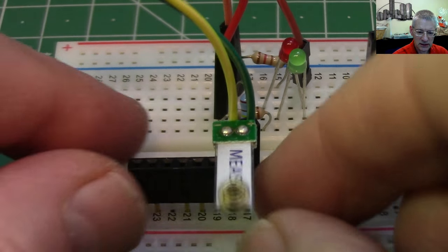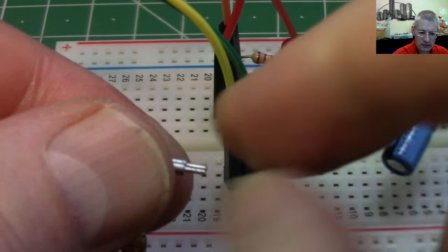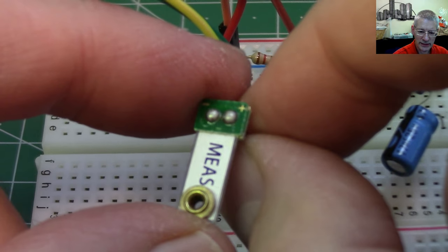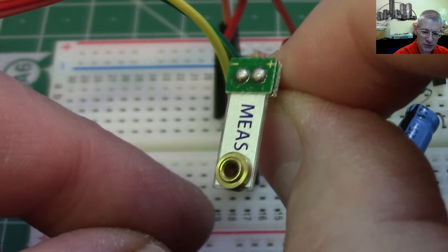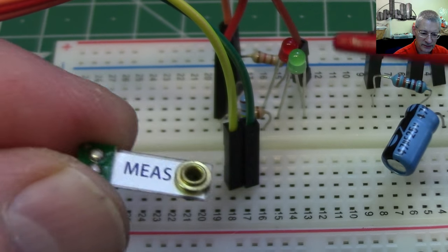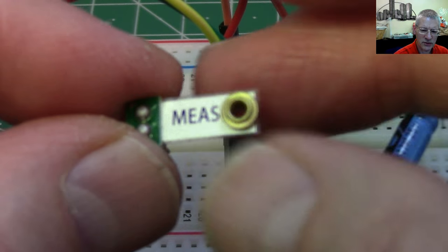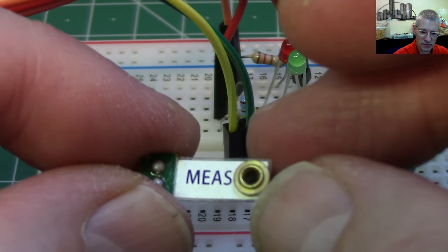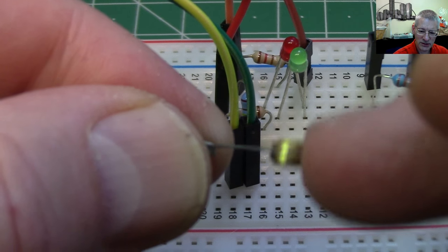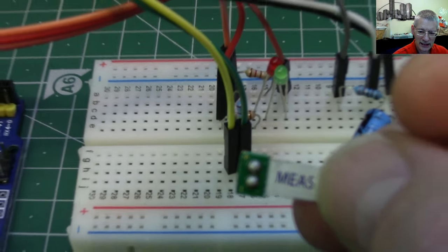You do have to be a little bit careful about soldering this — it sits on two little pegs. As you can see compared with my fingers, it's pretty small. This is the piezo bit on here, and this brass thing on the end isn't some kind of antimatter dilithium crystal — it's just a bit of brass acting as a weight. As this starts vibrating, the weight keeps it vibrating so you can detect it. That's all there is to it.